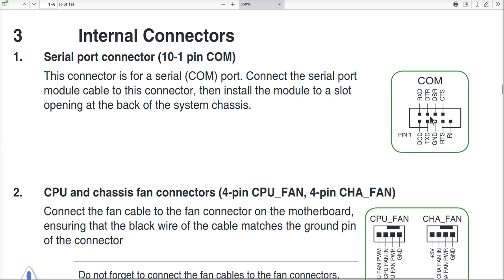of the D9 connector. And look at these pins over here. These are on the bottom row of the DE9. Okay? Because there are nine pins on the D connector and 10 on the rectangle, they remove this one here and sometimes they'll put a key in the connector. They'll fill the hole in the connector that sits down on the header so that people can't flip it around and plug it in backwards. All right? And that is clever and creative and probably a good idea.